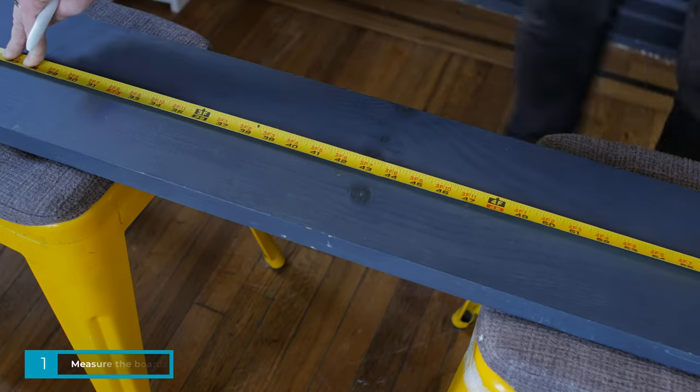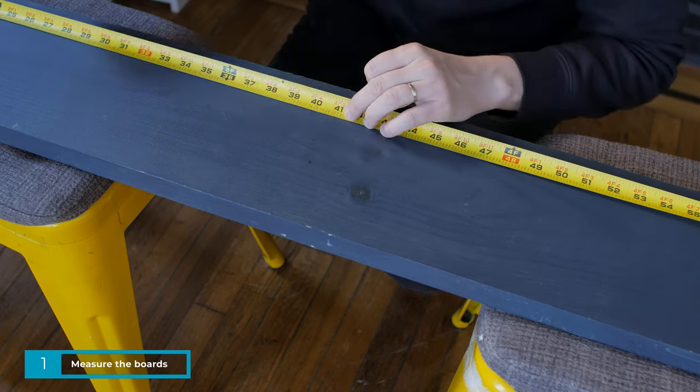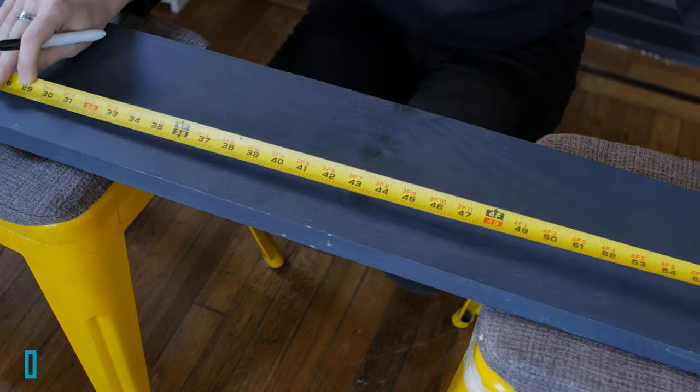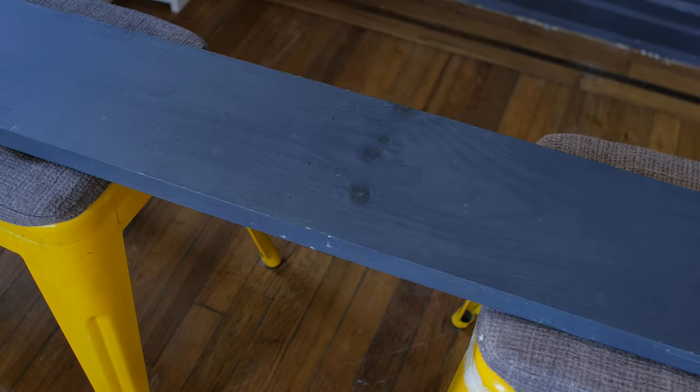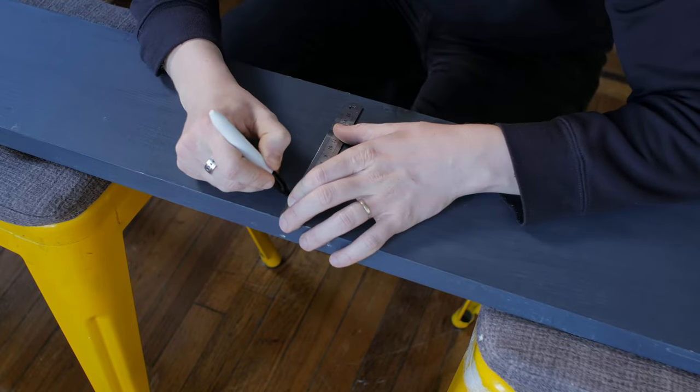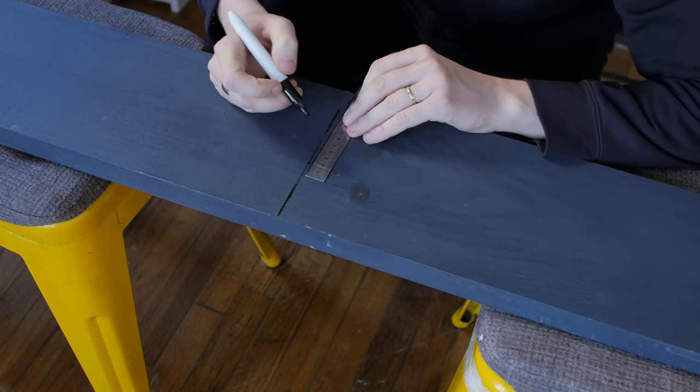To build the top shelves and create a full-fledged tabletop, I decided to use a long board, measuring 1x7 inches. Similar boards can be found at Home Depot for around 20 bucks. I need to cut two pieces, each 41 inches long, to match the length of the metal shelves.